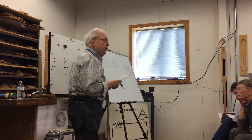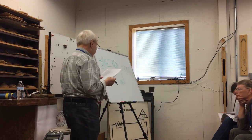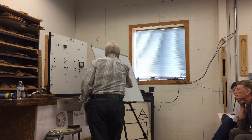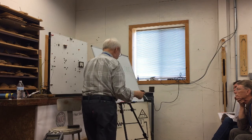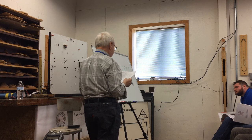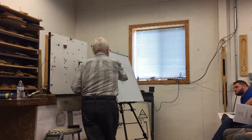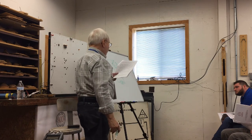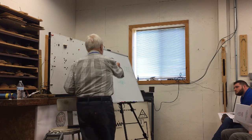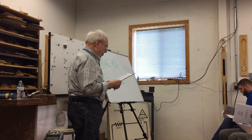So, having already done the alternator trick, we're diode pros, and we know we can put in a bridge rectifier. And look, Ma, you got DC coming out. And it's plus here, it's minus here. If we put our meter on this, here and here, we will see that we're getting only 14 volts DC, but we know we put in 15 volts AC. Where did the extra volt go?